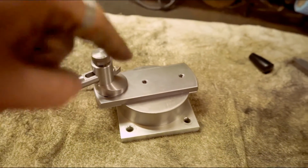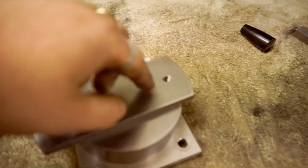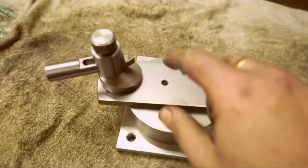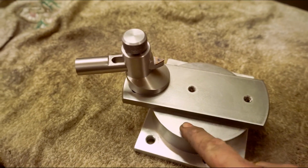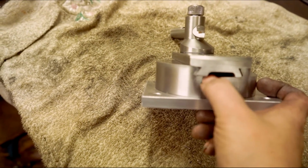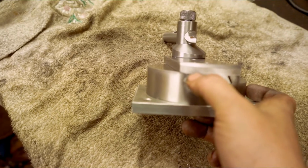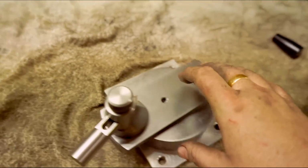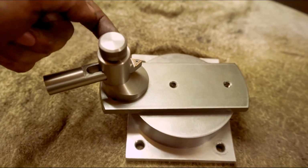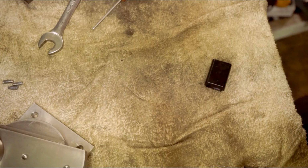Everything else I designed myself, and after I designed it and started making it, I saw another video with something very similar, a bit of a thinner bar. It didn't have, if I remember right, the mating surface underneath it that contacted with the top. It ran on the actual bottom. That's where the pressure was put, and it was a thinner bar. Instead of it coming up and across and up, it just came at an angle, the dovetail angle, and then straight up. So I didn't rip that off anyone else. It's just this idea. Dr. Finn's was a straight post. And I thought, how do I do this so it looks a bit flash?